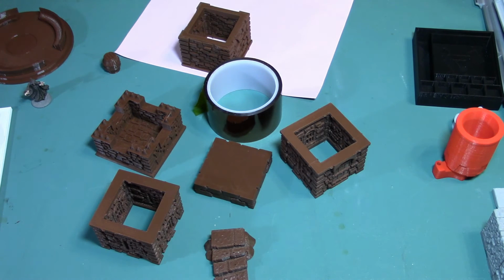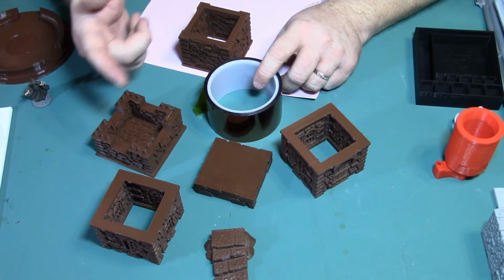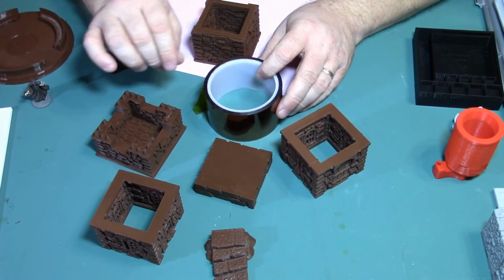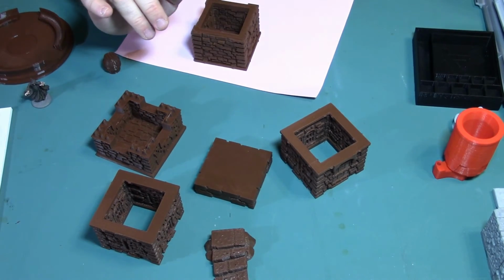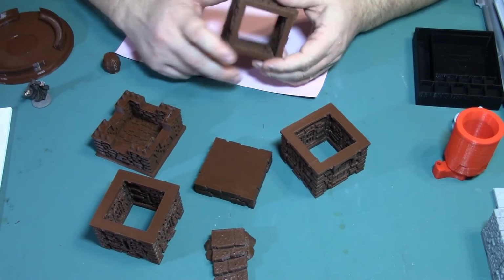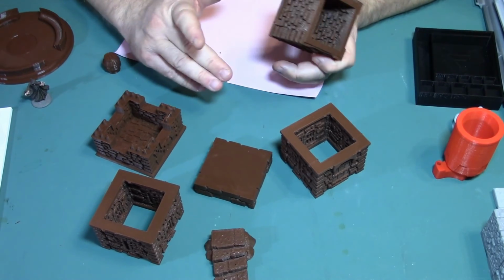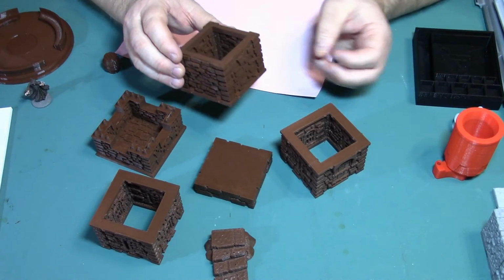It's supposed to be a little bit stronger than the Kapton tape. This is a 0.6 millimeter. So I put a sheet on last night, and you've got to put it on using this wet water method where you spray the glass, and that way you can reposition the sheet so you can scrape all the air bubbles out. It went pretty good. I've never done that before, so that was the first time. I'll get better as I go with it, but my glass surface is flat. Everything's dry. I'm going to start printing on it tonight for the first time.